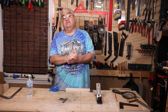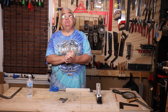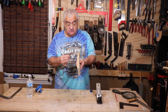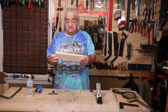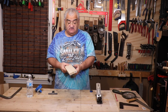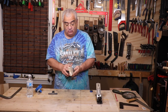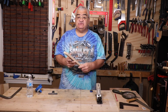The third thing that people struggle with — and this is the one I see most people struggling with — is the ability to mill your lumber square and flat. Here are actually two pieces of wood that I joined together and flattened. You can see the seam where I glued them. I did this to show that joinery can work well if you have good flat lumber. It was nice and flat and I was able to make it very strong.